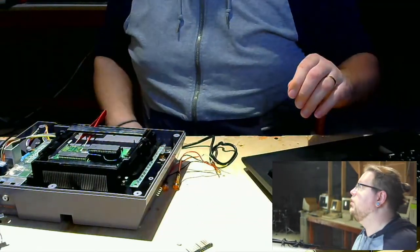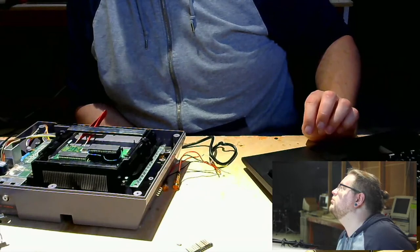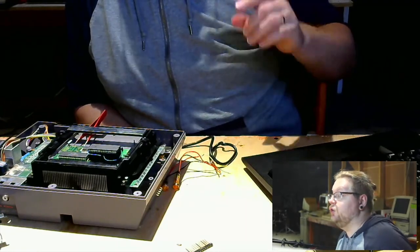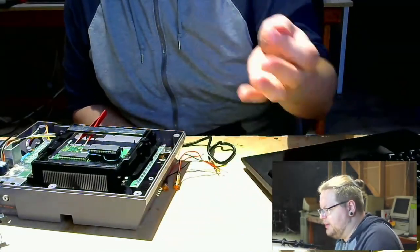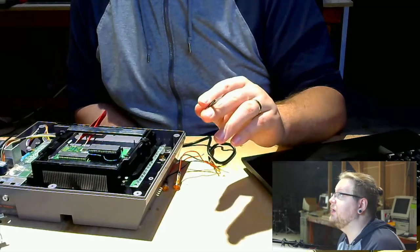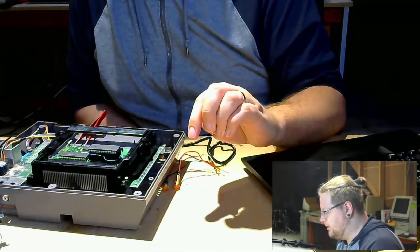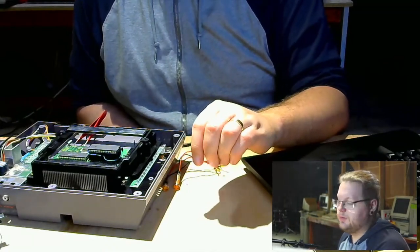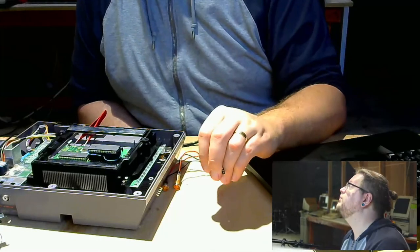Well, let me look at chat before we go crazy. Just use jump for unconditional branch. Jump uses a full 16-bit address. It's a question of why not, but in this particular case there is absolutely no reason not to just use a jump. But jump reads a full 16-bit address out of RAM, so it requires two memory access cycles, whereas a branch only requires one. That's the difference, because branch is relative. So if you're doing a little tight loop, you would really prefer to use branch over jump. And that's just why I knee-jerk use branch. I'm not a great 6502 programmer or anything.